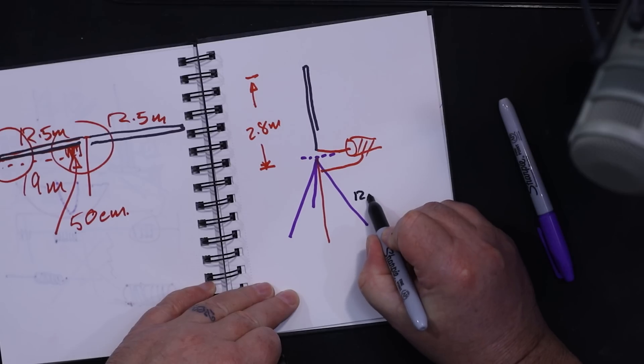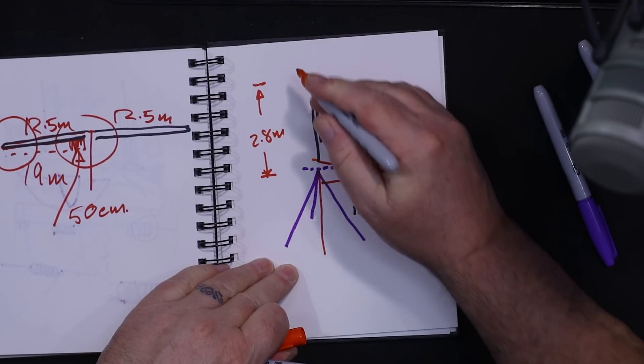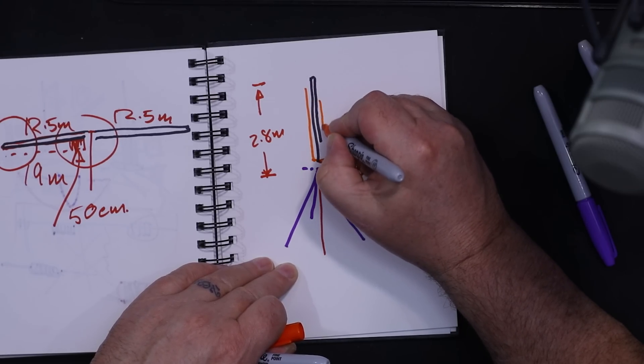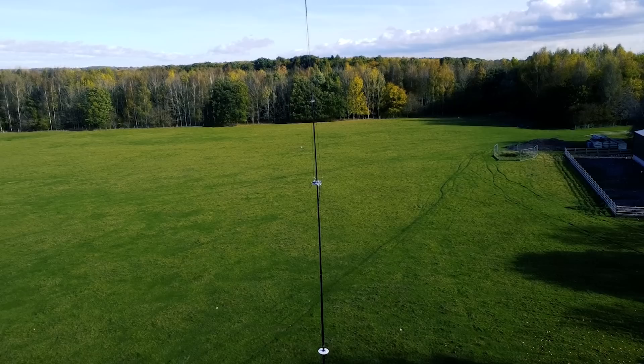The radial legs weren't ideal for 15 meters — I averaged them out to be ideal for about the 12-meter band. So I off-center fed the 15-meter element. Then I added another vertical off the side for 12 meters, and another one off the side for 10 meters which was a tiny bit shorter. They all worked. The legs were about three meters long — too long for 10 and 12 meters, actually too short for 15.